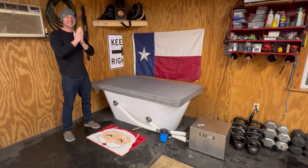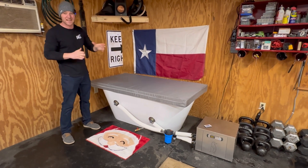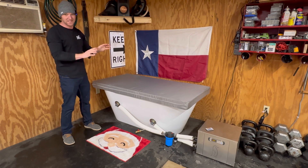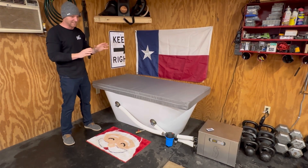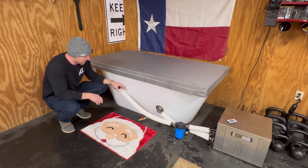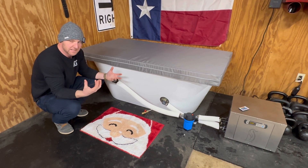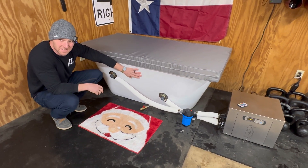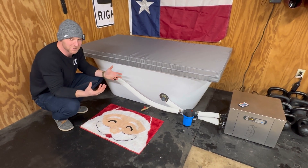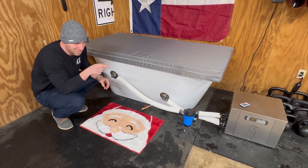This thing is sealed up. I had it set at 39 degrees overnight, and 14 hours later it only went up to about 45 degrees — so you're barely losing any temperature out of this sucker. I highly recommend doing this. Any exposed area on these pipes creates a lot of condensation, so if you don't have the inside sealed up and don't have any type of cover, you're going to end up with pools and pools of water. Insulation is very key, especially on these super strong cold plunges.